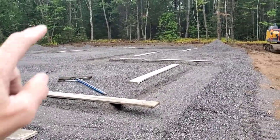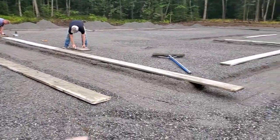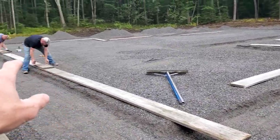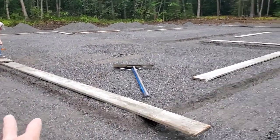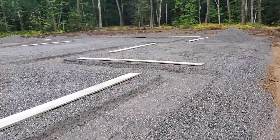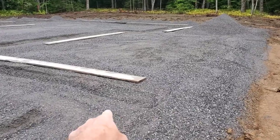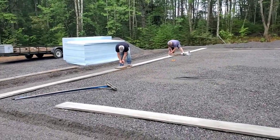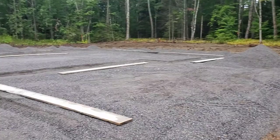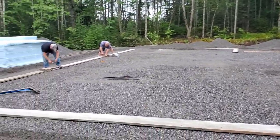We got a big house and garage slab we're foaming up. Got styrofoam right there — it all gets styrofoam under it. The edges are all haunched out, dug deeper. We're getting our boards screwed together so we can put them on the styrofoam after it gets laid in so they don't blow all over the place. We've got a guy coming out to set all our corners so we can make sure we're perfectly square — he's going to use one of those satellite scanners to get all our corner pins. It's 2,800 square feet of garage and house. We're going to pour it all at once.